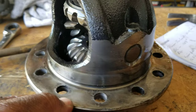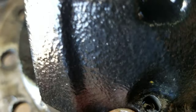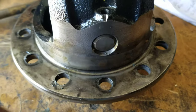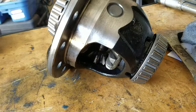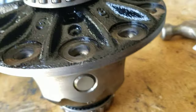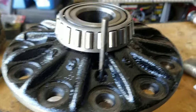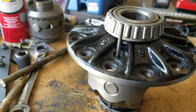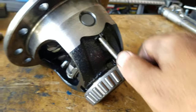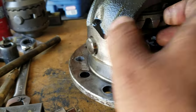To really get to the pinion and take it out, you have to remove this little dowel that's inserted here — it's a locking pin or dowel. Once that's done, this thing can come out. If you don't have a punch, you can use something like a drill bit. This little hole is designed so you can use a punch to punch the pin out. Use a plier to pull it out, and the pinion can now slide out easily.